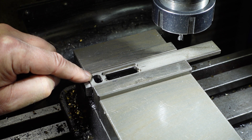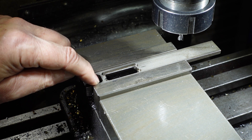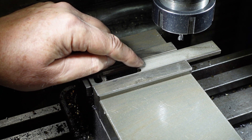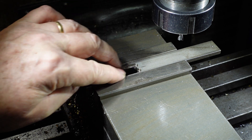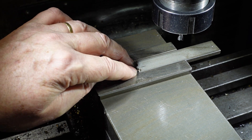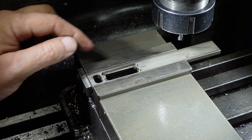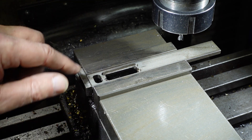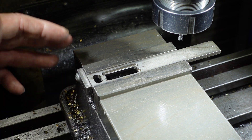These are the slots done — or nearly done — on the first one. I need to get in there with a file and square the corners, and also in this section I've overrun the corners because I've got a slider that sits in there and I want that to go right up to the end. So rather than binding in the corners I just overrun a little bit and that'll work fine. I'll now do the next one and then it'll be a matter of putting the crosswise cut in.